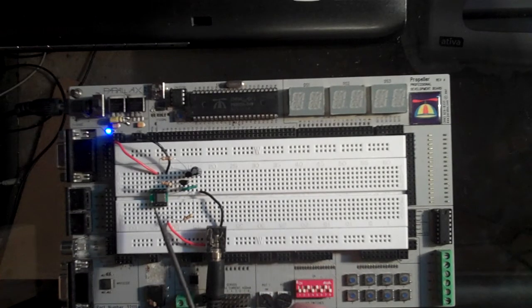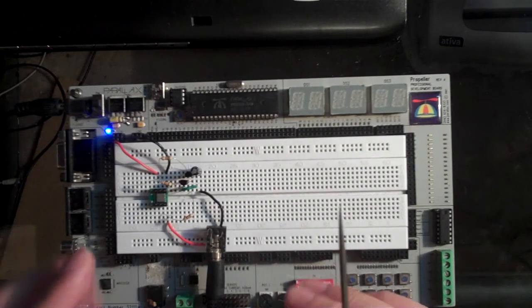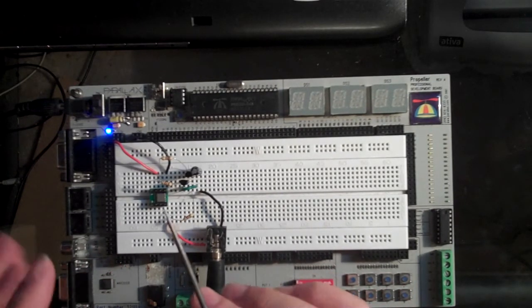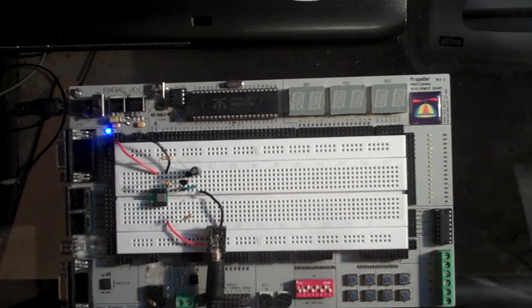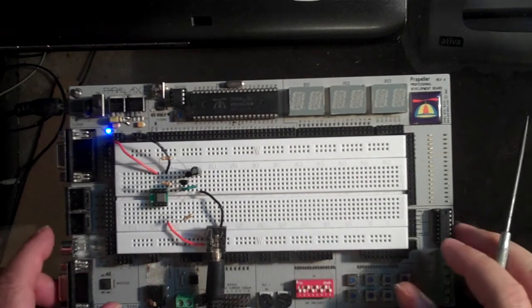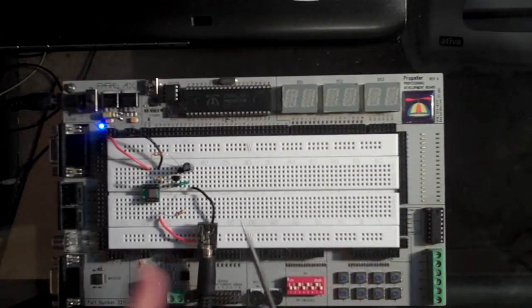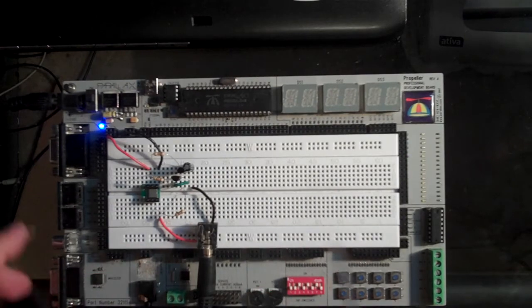So even though the Memsic 2125 only outputs a signal on each of the X and Y at about 100 Hertz, what makes it work on this is that both of the start edges between the X and the Y, they both start at exactly the same time. And if it's level, they should finish at the exact time. So as long as the inputs are equal or they agree with each other, then your output sound is going to be very low. If you disturb that in any way, you can audibly hear the difference.